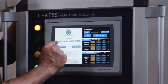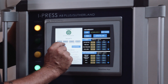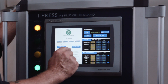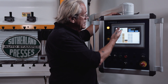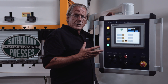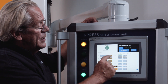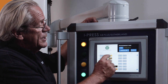The speed is set for 40 strokes per minute. Die height is set for 350.3 millimeters. Upper die weight is 1,000 pounds and your air counterbalance pressure is set for 2.8 bar. If you go to the cam screen, they've all been named when the press was received by the end user and wired in. As an example: air ejector, feed advance, pilot release, coil lube — easy to turn on and off, easy to change the angle of display.